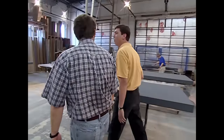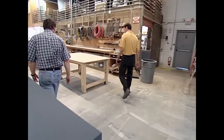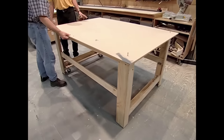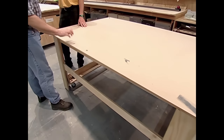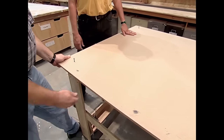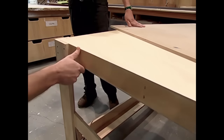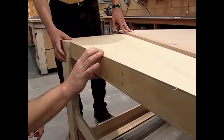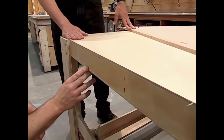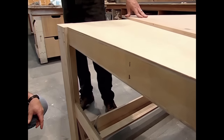The new and improved table version looks interesting and much lighter. Same four-by-six-ish size, with MDF on top as a replaceable top. Underneath it looks like a hollow core door — it's a thicker version of that. They glue a thin skin of plywood on one side and the top, and that resists twisting in the tabletop — it's essentially a stress-skin panel. The legs are made out of three-quarter-inch plywood, with a stretcher on the side.